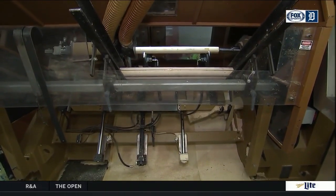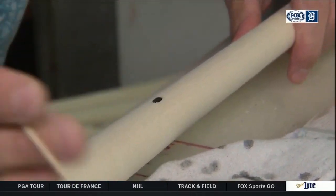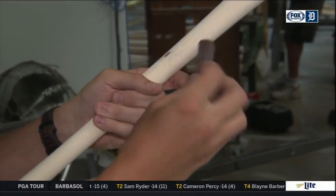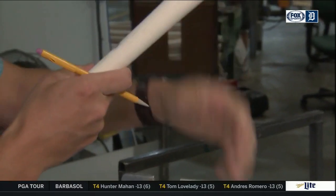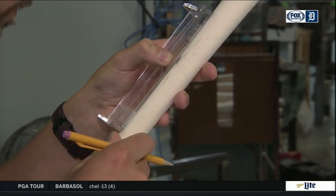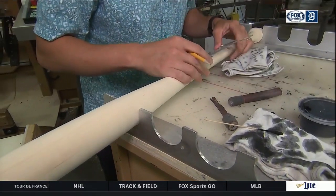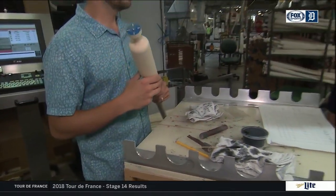The next thing that Tyler does is called the slope of grain test. This is required by Major League Baseball. We put a dot of ink on the handle, then he will take the protractor — just like a plastic protractor from 8th grade geometry class — and measure the straightness of the grain, or what is called the slope of the grain. If it is anywhere from perfectly straight, 0 to 3 degrees, it passes the test, meaning the bat has the integrity to withstand a 5.5-ounce ball thrown at 95 miles per hour against a 31-32 ounce piece of wood swung at 95 to 100 miles per hour. But if it's outside of 3 degrees, it fails the test and will become a souvenir bat.